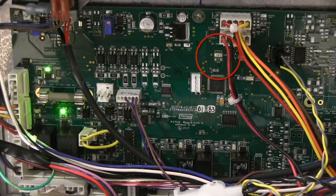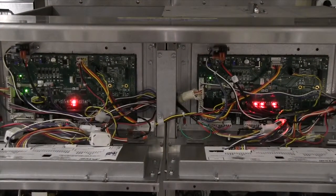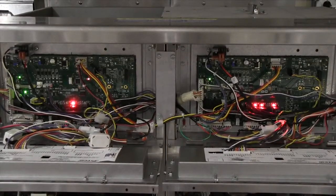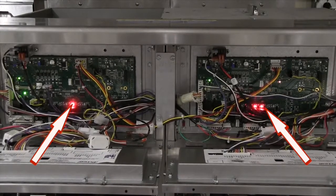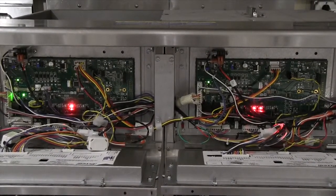As well, you should have zero lights on for the DC relays. The drain, return, and divert relays will only illuminate on the relay board of the fryer performing the task. The pump run relay will illuminate on all fryer relay boards across the battery. In this example, the right side fryer is the fryer performing the functions.